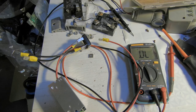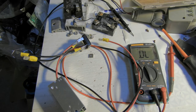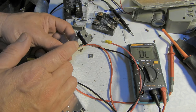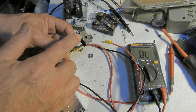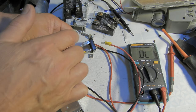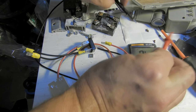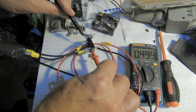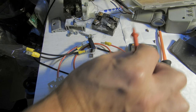I've been wanting to make my own regulator hold more close to maybe 13.2 or 13.8, something in that range. This bridge rectifier is not exactly what I want — I really need a 15 amp one, this is only a 10 amp one. It's rated for a thousand volts though, so I was curious about how much forward voltage it would have. It's only got 0.5 — that's better than I expected.